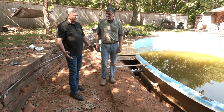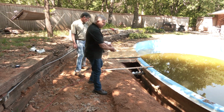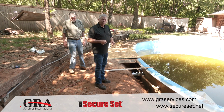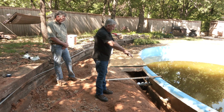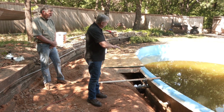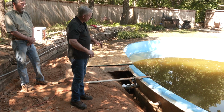Right, this is going to be a really neat project. Today, this is how we're going to tackle this problem. We have a large void here. We're going to use several mix and pour kits. We have some 5-gallon kits. We're going to pour it literally along the base, let it rise up, and we will then be able to determine how much we need to top it off.